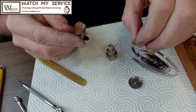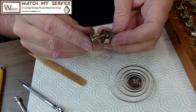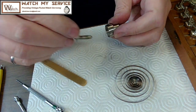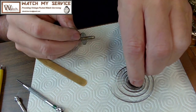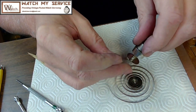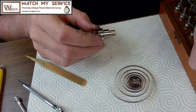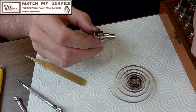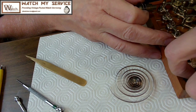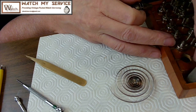Look at that, just right. Now the trick is this is clockwise, going like that, which means the mainspring has to go into the barrel clockwise, not counter-clockwise. So I've got to wind it on like that. I'll grab this device here and put the winder in like this into this little groove, then tighten it. Now it's tight — and now it's got to go into the barrel, which means I've got to start it on the winder like this. I look at the winder closely to make sure the hook is on the right side.